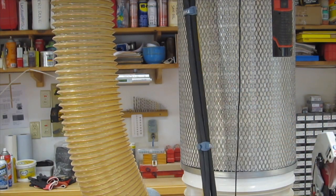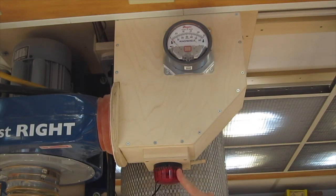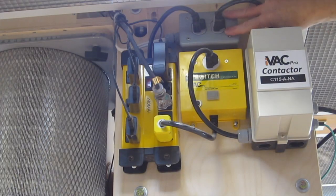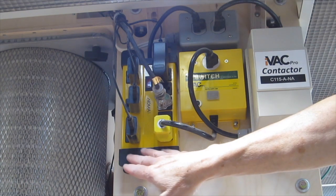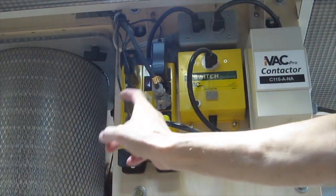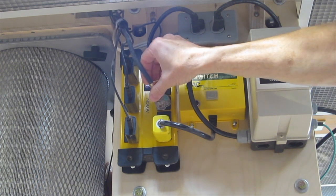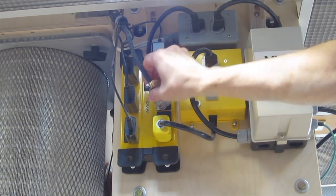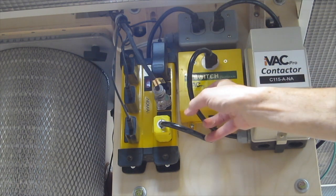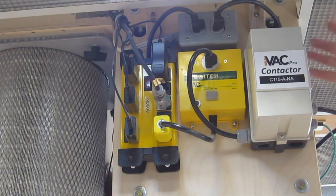All the wires that go from floor to ceiling are bundled together. A level sensor on the drum activates a flashing light when the bin is getting near full. The blower is mounted on one side of a bracket bolted to the ceiling. There's an outlet that goes directly to the fuse panel, and a power bar plugs into that outlet. The power bar supplies the tool sensors, the level sensor, the six IVAC blast gates, and power to the IVAC switch. The IVAC switch gets signals from the tool sensors telling it to turn on the blower through a contactor — which is just a big relay — and when the contactor is activated, power flows through it to the blower.